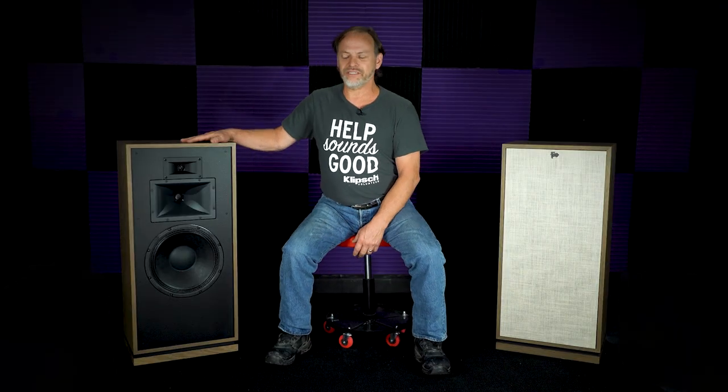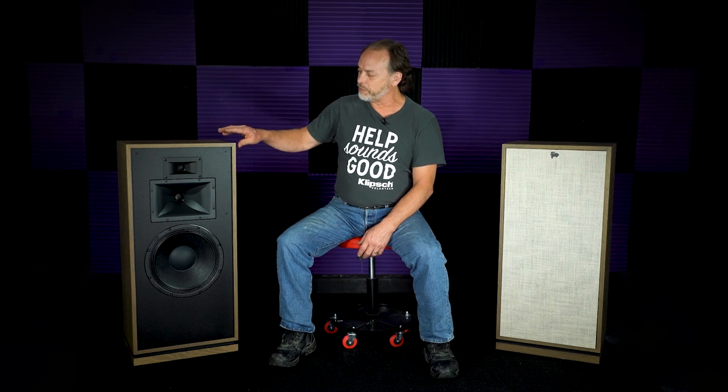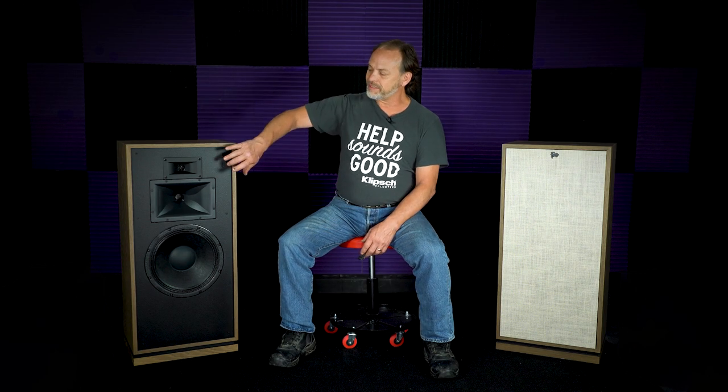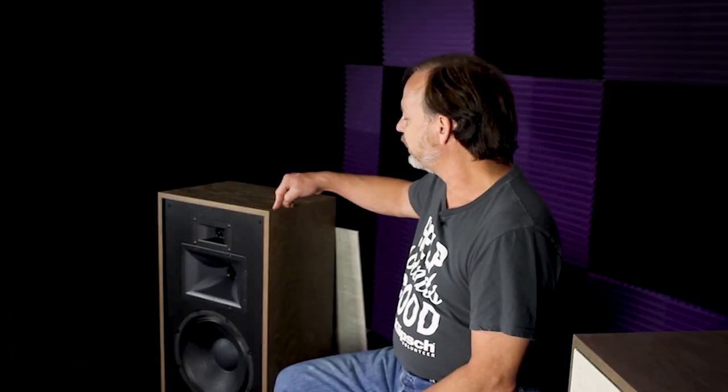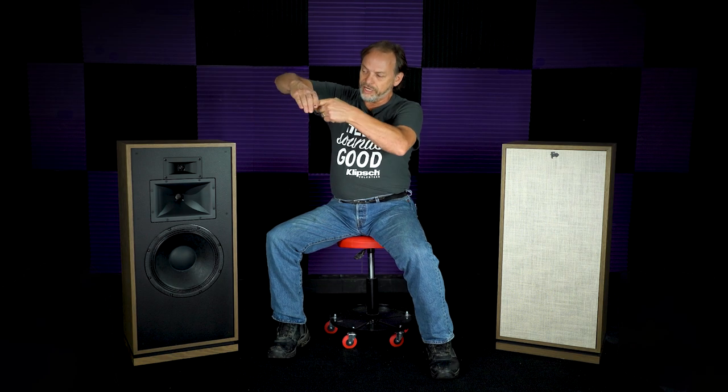It was a great learning experience for someone stuck in a small town without access to a lot of big PA — getting to be out in the plant and see some of the things you got to see. That's when I saw how they were folding these cabinets and insetting that motor board, and wrapping that cabinet up like they do. You basically have a horseshoe sitting in there, and then that motor board sets into that horseshoe, so you've got a groove at the top and the board sets up in it. You're getting a glue joint all the way around three sides of that board.